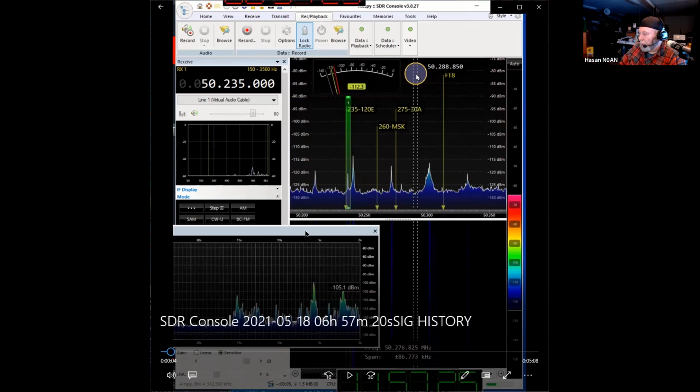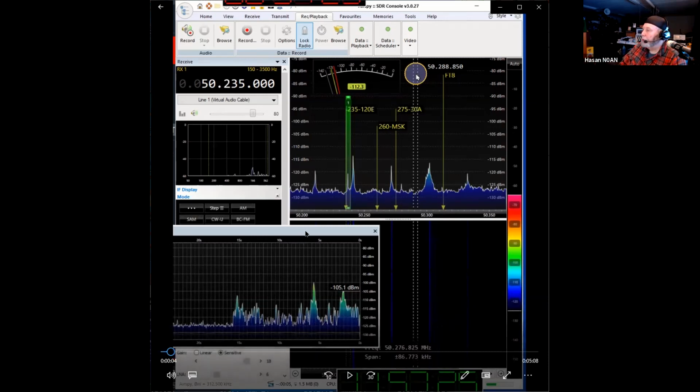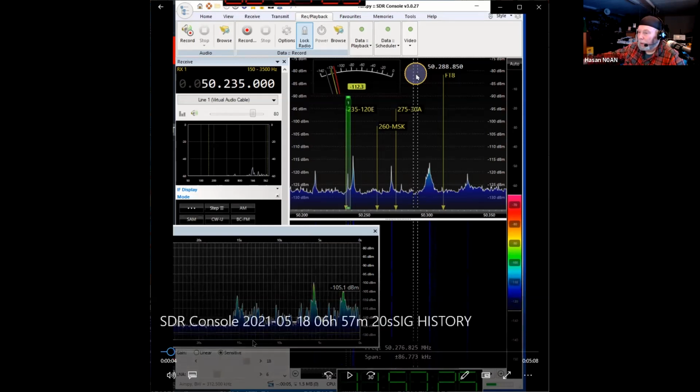One of the advantages, and I talked about this a little bit when I did the Q65 demonstration: when we run FT8, it is optimized for FT8. When we run MSK-144, it is optimized for MSK-144, which is made for bursts. Q65 is not optimized by propagation mode. It will use whatever propagation is happening at the time. So if there's a meteor ping, good chance to decode. If there's ionoscatter, it'll decode it. If there's sporadic E, it'll decode it. It doesn't care. We're going to watch this happen in real time.